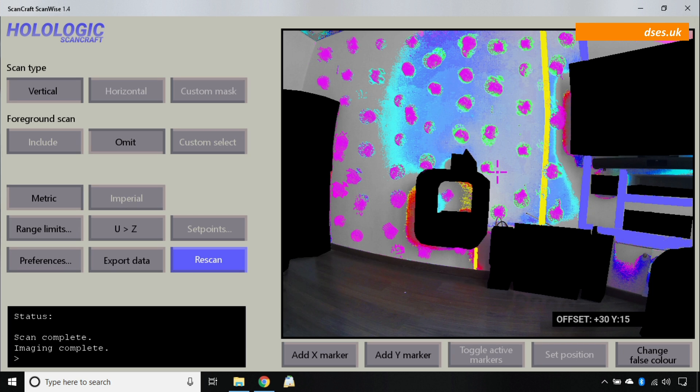Okay, brilliant — there we have it. These splats are the adhesive splodges that glue the plasterboard to the block wall. We can also clearly see a capped mains cable coming from above to serve the socket outlet behind my retro ghetto blaster, and this line here is the old gas pipe to the fireplace — not in service anymore but we can see it's still there. There's never been a radiator on this wall, but had there been we'd see the pipes show up regardless of whether they're copper or plastic. These yellow colours indicate a metallic return, while bluish colours show up for plastics, woodwork, adhesives and such. We can also see the woodwork showing in the stud wall section the TV is mounted on — the TV itself, like the fireplace and fish tank, has been blotted out as detected foreground furniture, so its presence isn't interfering with the rendered picture.